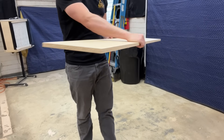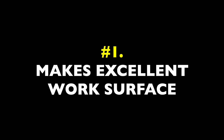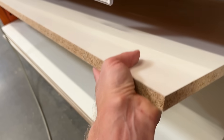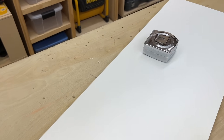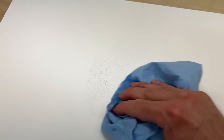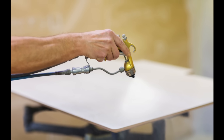While the edges are weak and frangible, the broad faces are actually fairly durable even when not veneered. Weight-wise, it's slightly lighter than MDF because it has less fiber overall and sometimes comes in slightly thinner dimensions. When people ask if particle board has any usable purpose for DIYers, I'd say yes. Most importantly, it makes an excellent work surface. Melamine particle board, if properly supported, is crazy flat and smooth — a perfect choice for craft tables where you need a glossy, low-friction surface. You can also clean it easily with mild detergents because of the laminate veneer, making it a hobbyist dream. It's really hard to get such a sleek, durable finish on other sheet goods — it usually requires careful veneering or multiple spray coats.